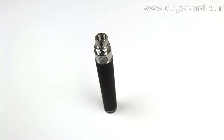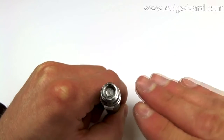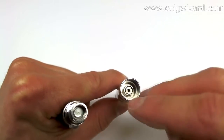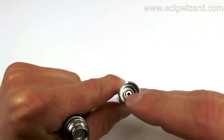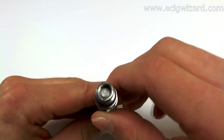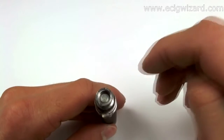What is that? The center pin issue is if this little plate inside here is too low and doesn't make any proper connection anymore with this little pin inside here, with the positive pole of your atomizer, which is this bit in here. Most people think the battery is completely faulty and you can't get it to work anymore — that is actually a little mistake.